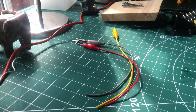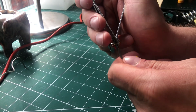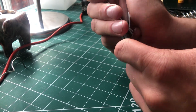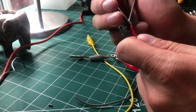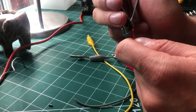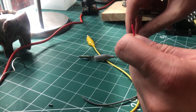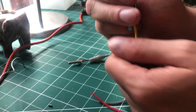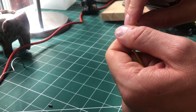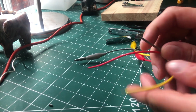So the next step is going to be to trim up our wires. You can see I already chopped them in half. I'm going to use the nail clipper to very delicately expose the wires. It is a little easy with these nail clippers to just chop straight through, so you want to do it relatively delicately, just to get the tips of the wires exposed. There you are — it's got three nice wires now, ready to be tinned and connected.